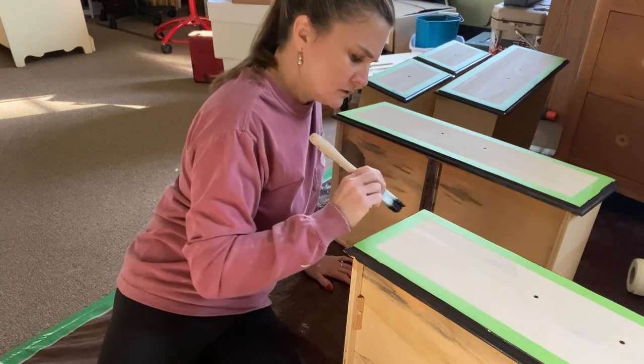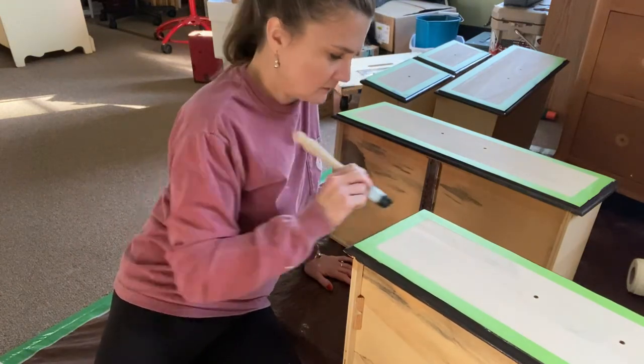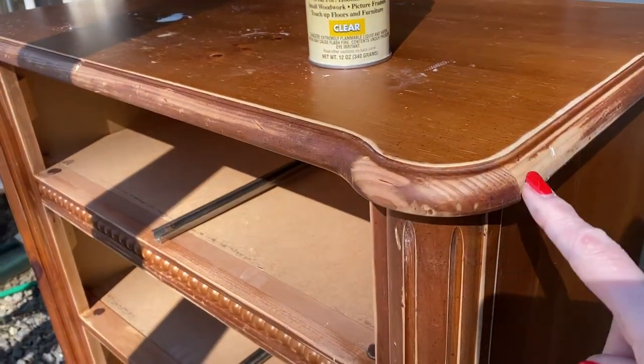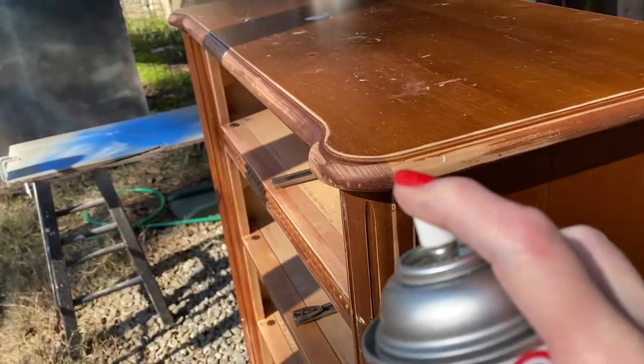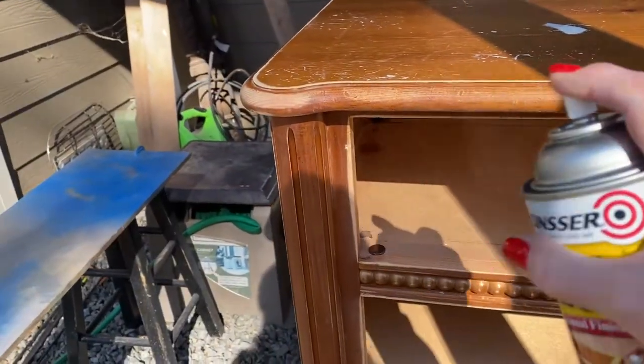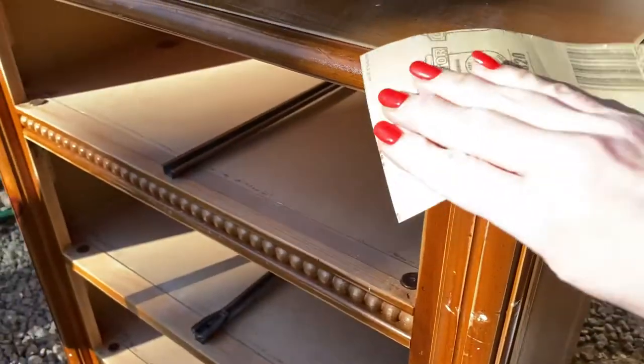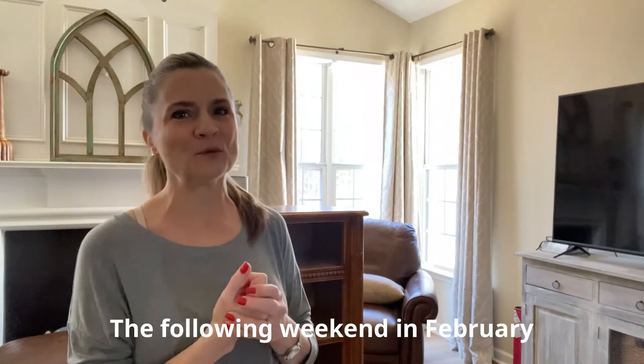This is the first coat and I wholeheartedly expect to need at least one more. I sanded the edges with 220 grit sandpaper, and in the areas where I went down to raw wood, I did spray them with some shellac-based primer by Zinsser, then lightly scuffed it so it won't be a shiny spot where the paint will adhere differently. Today in the Atlanta area it is 29 degrees, even colder than that. In our enclosed garage it's way too cold, so my husband said, well, if you're going to be brushing it on, why don't you paint in our den? You'll be more comfortable and you can watch YouTube videos while you're painting. He's been so supportive — I just couldn't believe it.